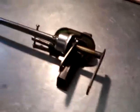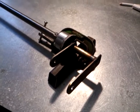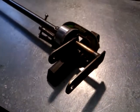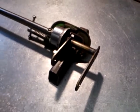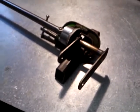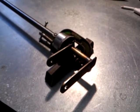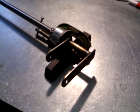So for one reason or another I've had to fit the handbrake lever to the right hand side of the driver's position as opposed to the centre of the car as you'd expect. Now the problem that gives me is that in order to connect that handbrake lever to both rear wheels via handbrake cables, one cable would need to be much longer than the other. Now that's the case in the Porsche 944 and they get around it by literally doing that. Now the reason why I want to avoid that is because I think that if I use completely different length cables, incidentally one is going to be about 2.5 meters long and the other less than a meter, so significantly different, I may have problems balancing the handbrake pressure and tension a bit later on.